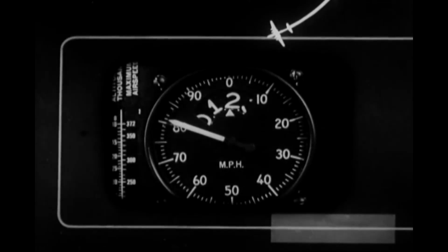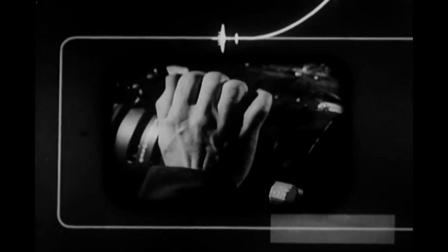Altitude is 2760, speed is 180. Here the co-pilot lowers the wheels. The mixture controls are set to auto-rich, and the cowl flaps open 15 degrees. At the end of the downwind leg, the speed should be about 140 or 150, and at least 3 generators must be on. The co-pilot lowers the flaps 15 degrees.